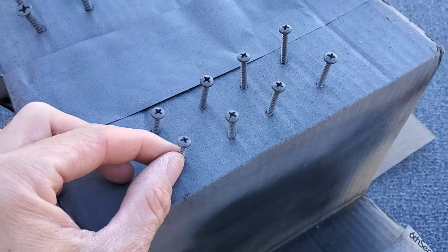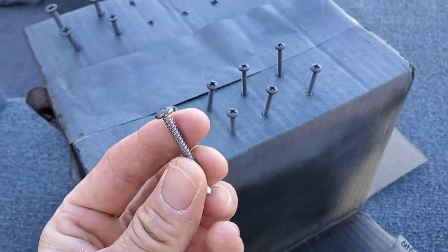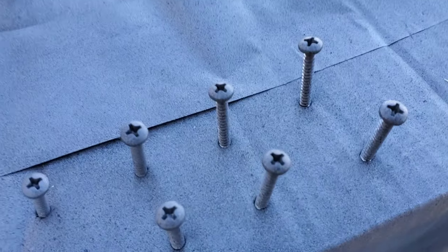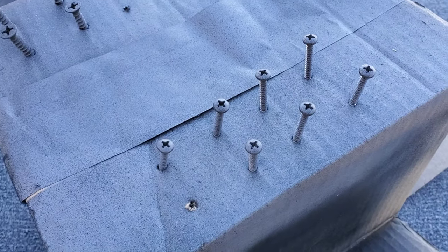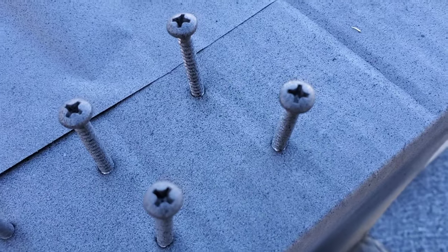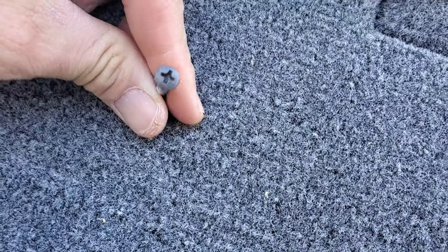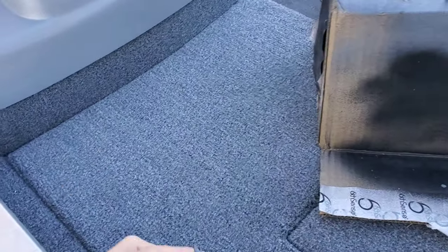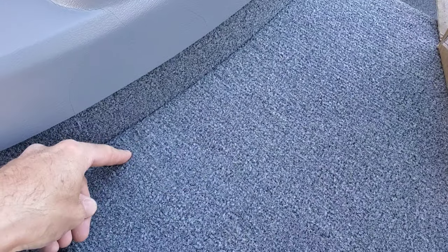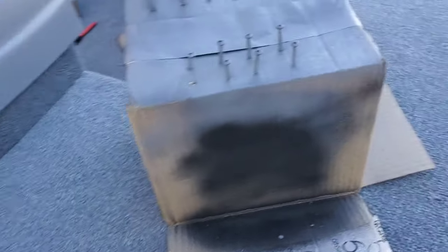Here are the screws I'm going to use to tie this panel down — these are inch-and-a-half stainless steel, number eight size head, self-tapping screws. I purchase these on Amazon — a pack of 100 for only 10 bucks. I'll leave the link below. What I do is take a matte gray spray paint and hit them with the matte gray, then come back and lightly mist some black, and it gives you a look that when you tie these down through the carpet, it blends in and won't be super obvious where the screw heads are. The inch and a half is enough meat to get through the wood, through the carpet, and if you've got a lap on the underside with carpet, it burns through everything and hits framing and tightens down.